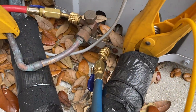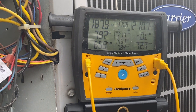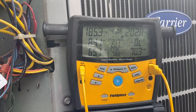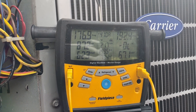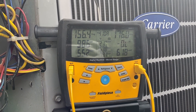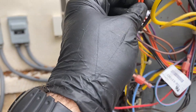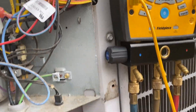There we go — suction line, common port pressures are changing. We're bypassing the TXV and going straight to heating mode. Our temperatures are about 79–80 degrees inside, about 75 outside. We're bypassing the TXV because it has a check valve, and we're checking the refrigerant in heating mode. Even though temperatures are a little high, we're just getting an idea of the pressure readings. Suction port reversing valve signal is off, and our suction line gauge is reading 142.